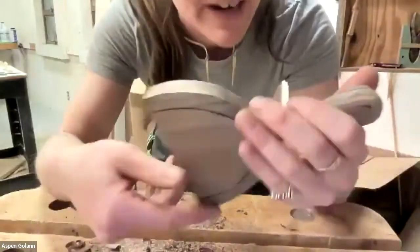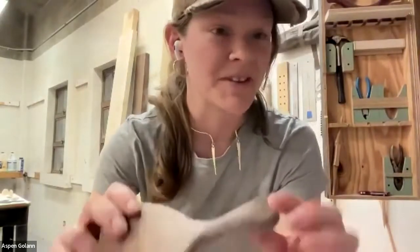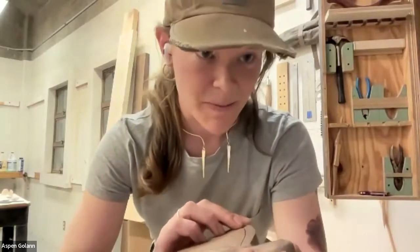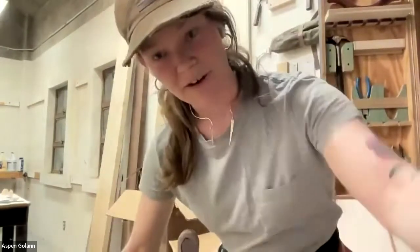And it's rounded over. So the last steps are basically just smart use of hand tools. So now I have all these hideous rasp marks. The next move is filing and then card scraping. And then ideally you should just be hitting it with the lightest possible 220 grit and then French polishing and you're done. Part of the beauty of it too is that you end up with this incredibly gorgeous curved surface with tons of end grain, tons of grain direction shifts, and you're barely sanding at all. So yeah, card scraper, file, and I'd be ready to French polish.